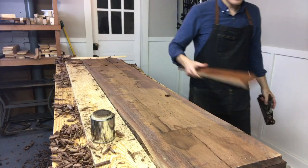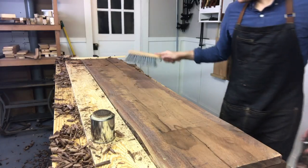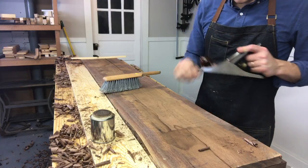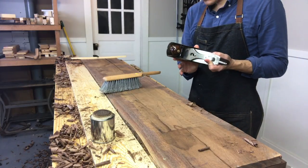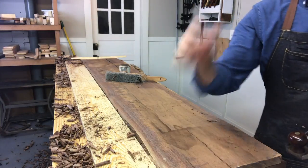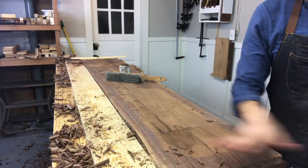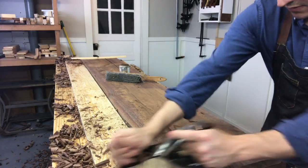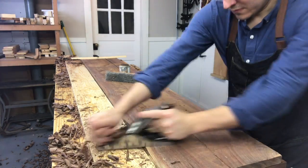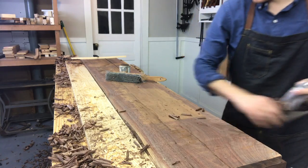What it is right now. The blade, the iron on this thing still feels like it's going strong. Still got a heavy cut too. All right, I'm going to traverse it perpendicular to the grain right now. Gotta be careful of that clamp. Oh, that's nice. That's a full length shaving on this end here. That's great. All right, we got some skipping. Not bad though.